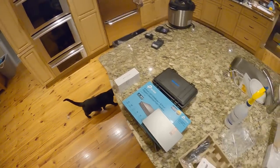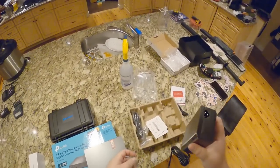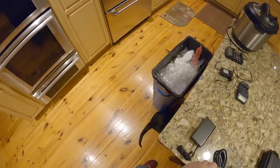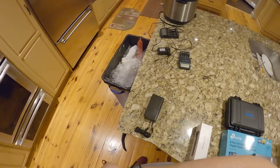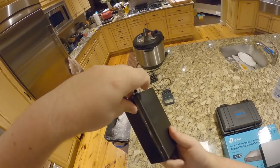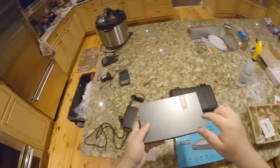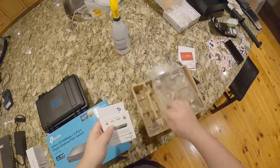Really nicely built with little rubber feet. It takes a 53.5 volt, 2.4 amp brick — that is a monster brick. So now I'll have one monster brick instead of multiple separate PoE injectors. I'll plug this in — boom. I'll put this on my basement rack and should be able to plug most of my Ubiquiti stuff into it. I still need to read what that recovery mode does.